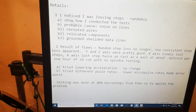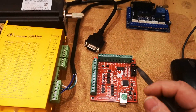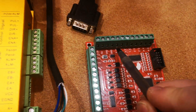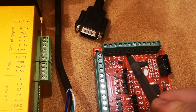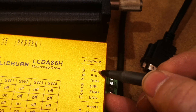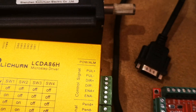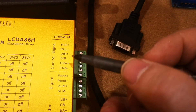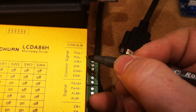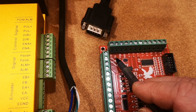The conclusion — I'll jump to that in case you don't want to listen to the rest — is that when you program the P and D of the different axes, they come out as X, Y, Z, and A. They can hook into either the positives or the negatives. The way I originally had it, these were hooked to the negatives — the negative pulse and negative direction — and I tied the positives together and ran them out to the five volts. That caused the problems.